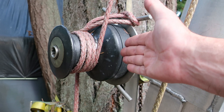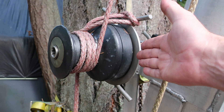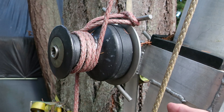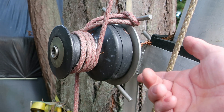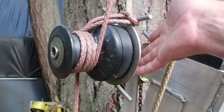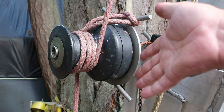This is the boom lift winch — it fits in a receiver the same as the uphaul winch. Running cleats on here means that when I remove this winch, I can use it in a different location — attached to a truck, a car, a receiver hitch, or wherever it needs to be used. It cleats off and ties into itself, while the slewing winches are bolted in and the cleat is part of the main structure.